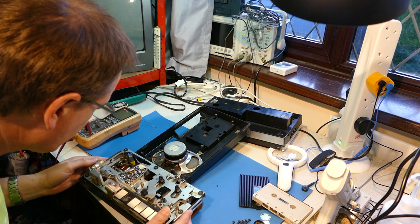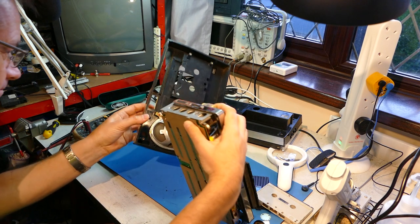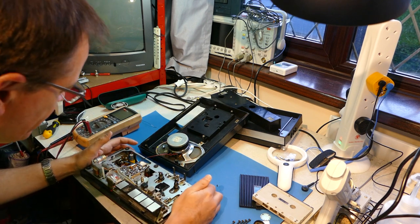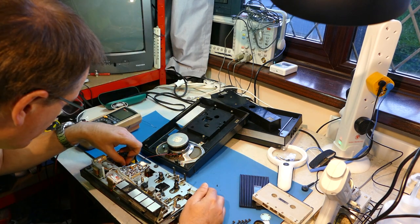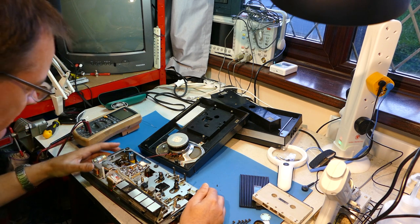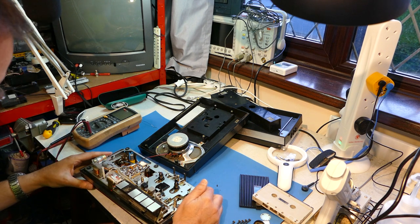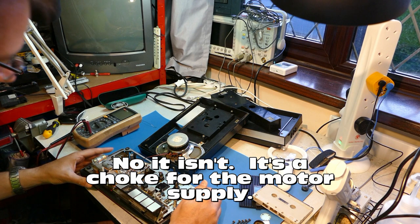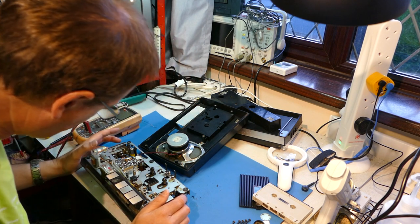And I don't believe it is. Oh, hang on — it might be. Because at least one of the wires goes to the battery terminals at the back here. The black one goes to this wire here. There's a red wire, but it's very, very thin. I can't believe that's the main power wire. And a blue one, which seems to come to the top. Maybe that's something to do with the battery meter. There's a transformer there — that must be the audio output transformer. So yes, it does appear to be a DC input socket there, but I have to be very careful.